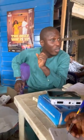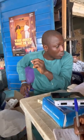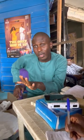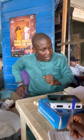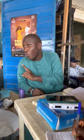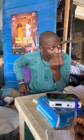We have what we call the stranded cables, and we have what we call the core cable. As an upcoming installer, I will advise you that you use the core type. Core, the spelling of that is C-O-R-E, means that there will be only one single conductor inside.